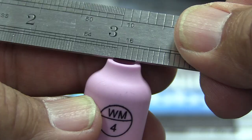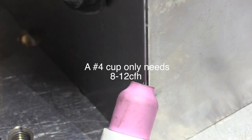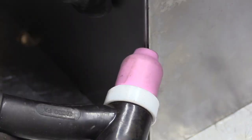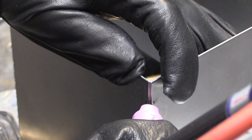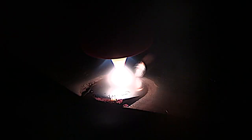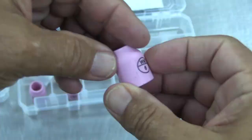Where would you want to use these cups? If it's a Sunday afternoon and your tank is down to about 200 or 300 and you've got a job you need to get out and the job doesn't really require super excellent shielding, a 4 or a 5 cup makes sense. It also makes sense for flash tacking — you don't waste a lot of gas while you're just doing a little quick burst tack on some sheet metal corner joints. There's a purpose for every cup. If one size does not fit all, the number 5 cup is great for aluminum butt joints — it can actually help with penetration by limiting that cleaning action and focusing the energy on the puddle.